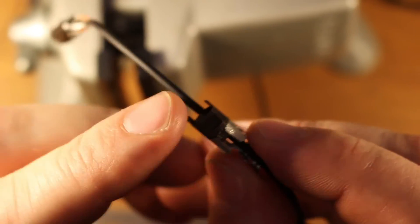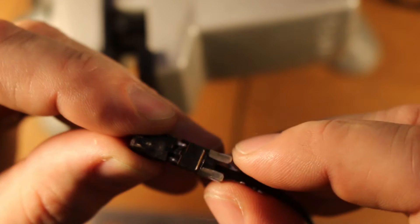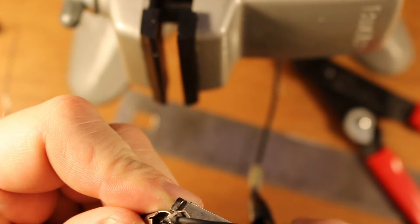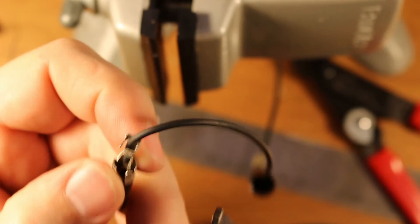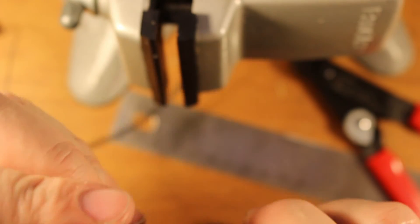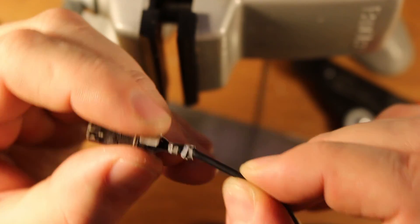Make sure your plastic is in the correct groove of the metal crimp part and slide it up. If the solder blobs are a little too big on the top pins, it doesn't let the thing quite land right — usually you can force it past, and it actually helps the whole thing stay snug. But if it's fighting you too much, you want to make those solder blobs smaller. Mine's actually come together pretty seamlessly. I'm going to really make sure these grab so that next time talent decides to take off their mic without telling me, it can withstand a little more abuse.